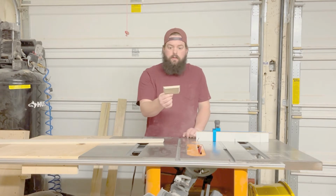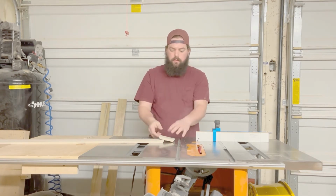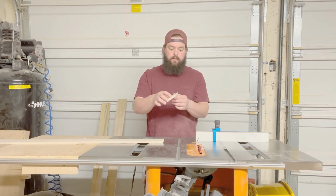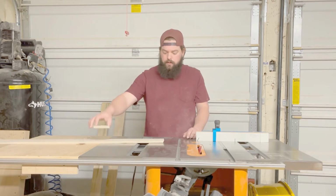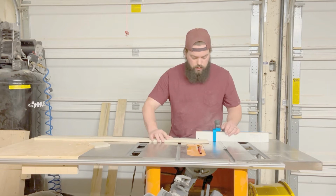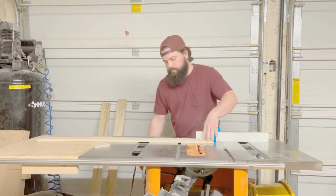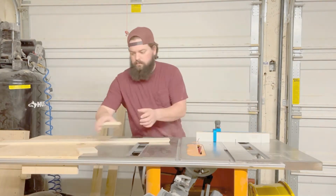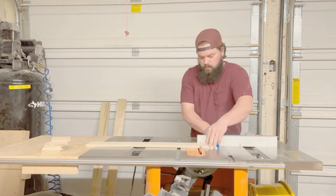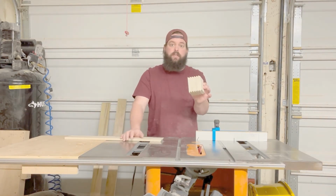So your first cut's going to look like this. You can see both edges are pushed in, and we're going to do 6 sides per. It's a hexagon, and when we tape it all up, it'll fit together. Every time you go to make a cut, make sure you flip the board on your stop block like that, so you get the right cut. Okay, let's just run through them. So we have all 6 sides for the small.